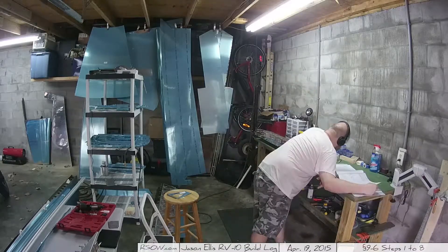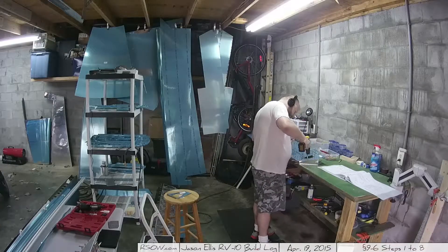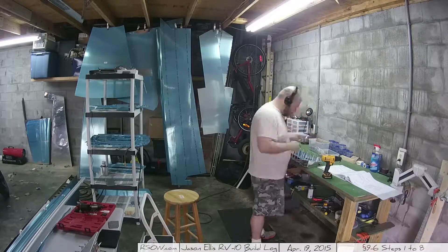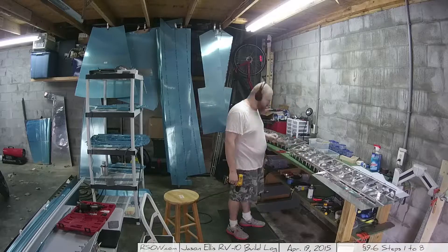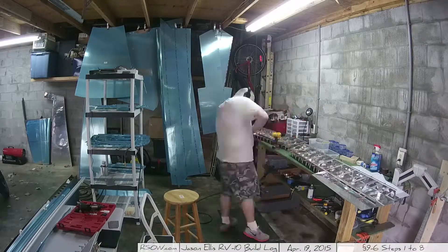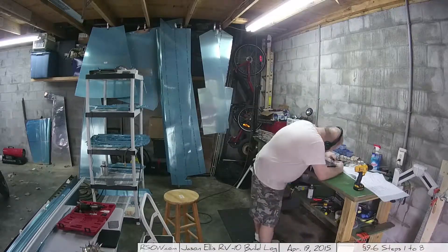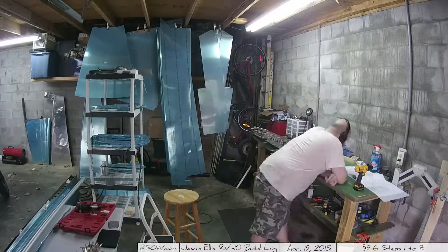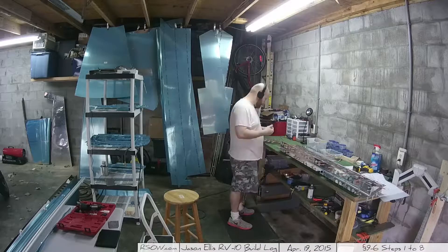This is the beginning of section 9-6, where I'm working with the trim access and the bottom skin on the elevators. That hole right here will actually have cable running through it, and you've got a cover that fits over the slit in the bottom. Here I'm drilling all those various matched holes, and then once I'm done, I do it on the other side - you do everything twice, at least if not four times. The next thing I have to do is grab a gusset - a little chunk of aluminum for strength - that goes against the root rib and the rear spar. Once you get that done, it's time to put the tip assembly on, and once you see that, you realize now it all has a real shape and you see how it all goes together.